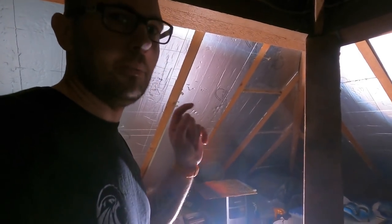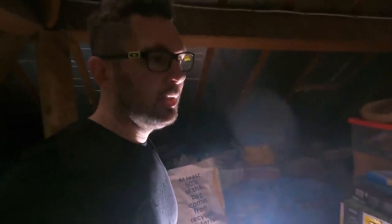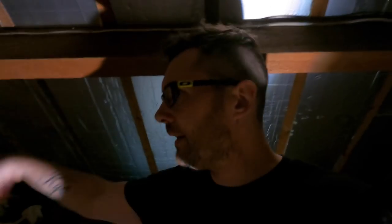Now what I'm going to be doing, which was discussed with the client, is where the lights are, for example down this way, if there's a light down there, which there is on that bit, I'm going to drill straight through the floor, straight through this board, because there's no way I'm taking all this up. It's not been priced for, and to be fair to the customers, they're like, yeah, that's fine. And then I'll run all the cables around the outside, so for that one there, it's gonna be drilled up across this beam here and then straight back up into the box, and then various points, like one in the landing, things like that.